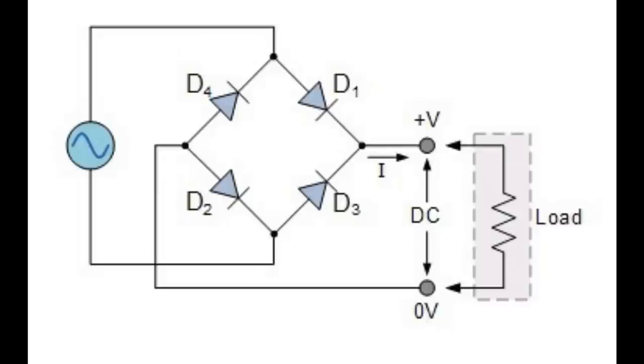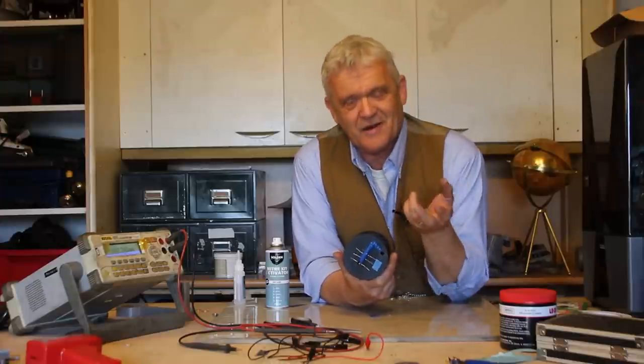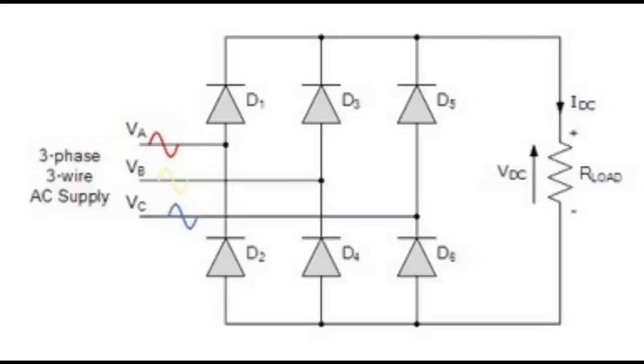You have choices here. One way — the way I've chosen — is to take each individual coil and rectify it using an individual rectification circuit. The other way is to take all of the coils together and rectify as three phases using a three-phase rectification circuit. I've done each coil separately because, to be brutally honest, I don't quite know yet what I'm going to do with it electrically. On one side I've got all my positives and on the other all my negatives, so I've rectified each coil individually to give me three positives and three negatives. You don't need to do that — you can rectify all three coils in a three-phase rectifier circuit to get one positive and one negative.